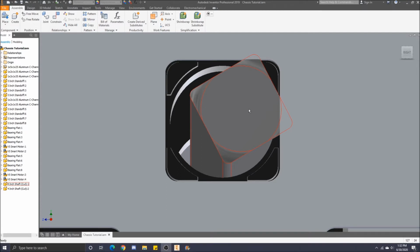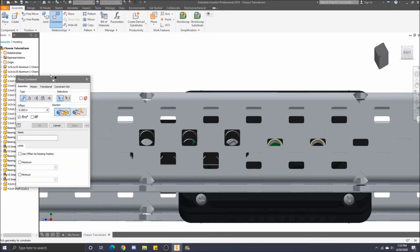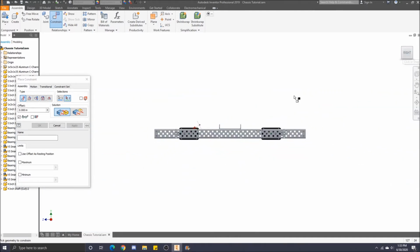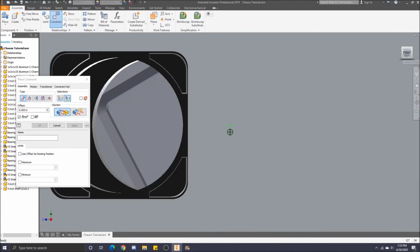Okay, so once again, we will need to insert or mate this face that I'm coloring in with my mouse with the inside face. So the first thing we're gonna do is zoom out again because we do need to drag this to the side. So just click, hold, and drag it to the side. And then we're going to press constrain, mate tool again, and we're going to click this side of the axle. Then we're going to do the same process again. We're going to go to the right side, zoom in all the way to the little insert, ever so slightly rotate it,